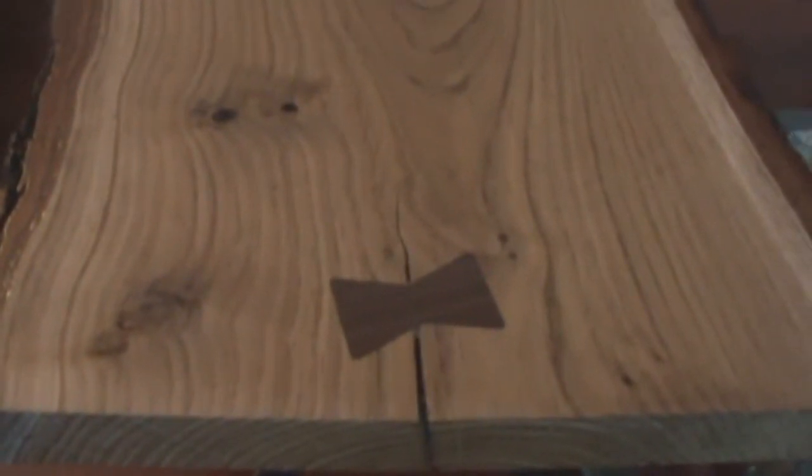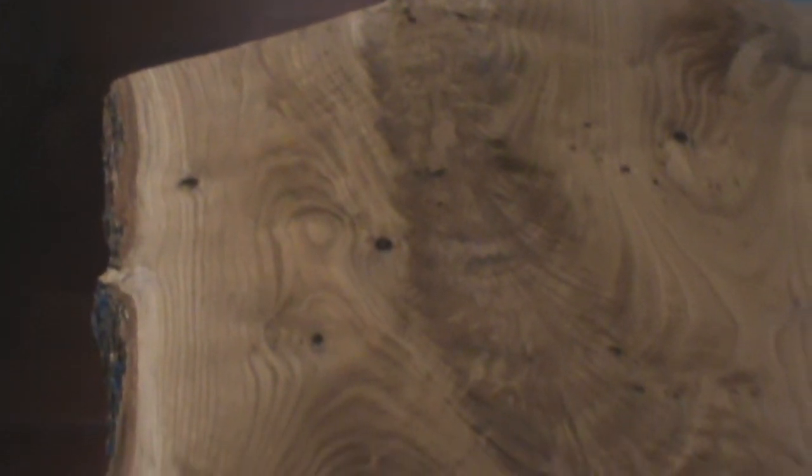Here's the bow tie that I laid in with walnut. I also did one on the bottom just to make sure that crack didn't go any further. It really isn't very difficult to do this type of table — it's just very time-consuming. I have a number of hours of sanding on this piece, but I think in the end it came out pretty nice. On to the next one.